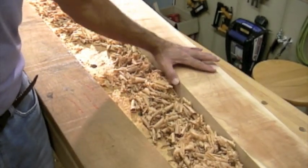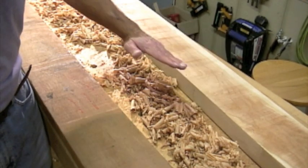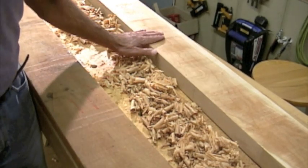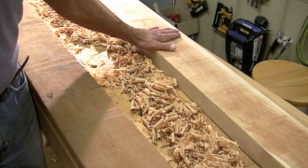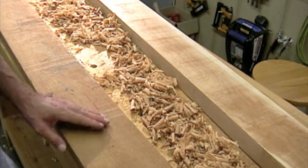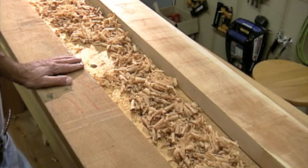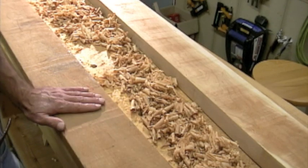This is a board that I just finished — it's a little bit smoother. You can see that the board had a little bit of a concave shape, so as I was planing it, the edges here were starting to get better. The center is still a little rough, but it's good enough for my next step. This is a fully rough board. You can see some of the milling marks in it, some paint on it, some marker over here. Just out of the picture there's a knot. I'm going to work around those things and smooth this down a little bit.